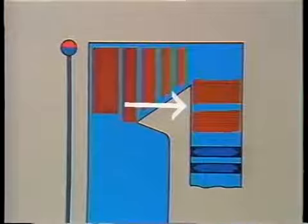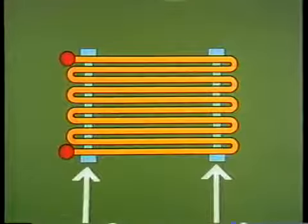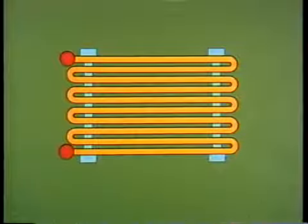Some supports for the horizontal superheaters are located within the hot gas path. Usually this kind of superheater is supported from above. However, there may be tie bars to hold the superheater's bundles together. Tie bars also provide support for the lower parts of the tube elements.